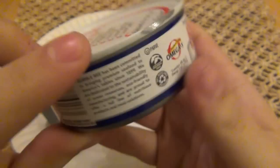Now I'm just grinding one section. Luckily this whole lathe is painted white, so you can see where the point of contact is. It's going to be very hard to tell, but it's a little bit thinner where I was grinding, and you can see where the paint came off very easily, all right? And I'm going to do that all the way around. You want to do it evenly, but I'm going to stay in this one spot until it breaks through just a little bit so I can show you that.